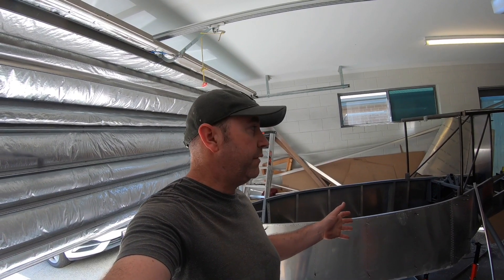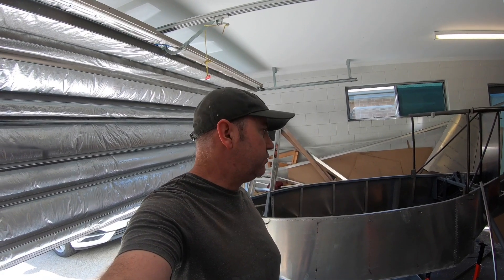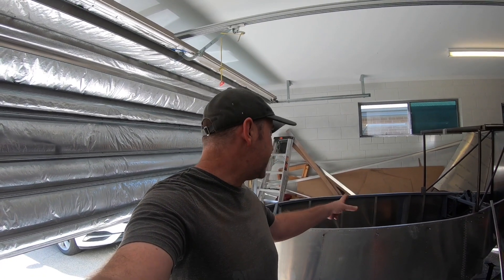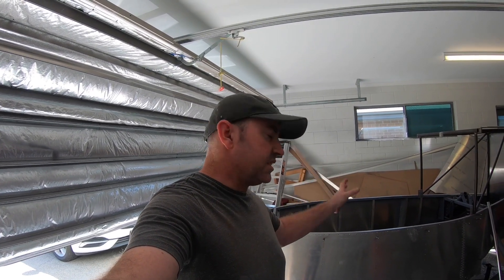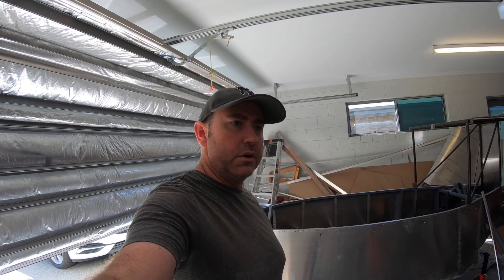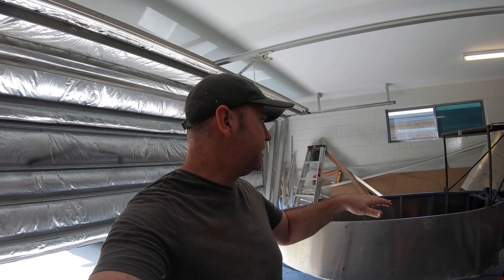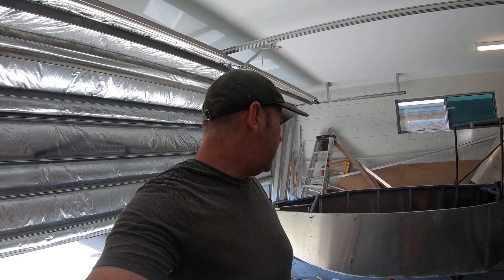The aim is I want to get this thing floating very soon. I want to test it — at least drop it in the water. I want to make sure my waterline that I calculated is right. I'm going to load some sandbags in it to get some weight into it. I want to see what that waterline is, because for the sponsons, I want those sponsons just on the top of the water when it's sitting there.